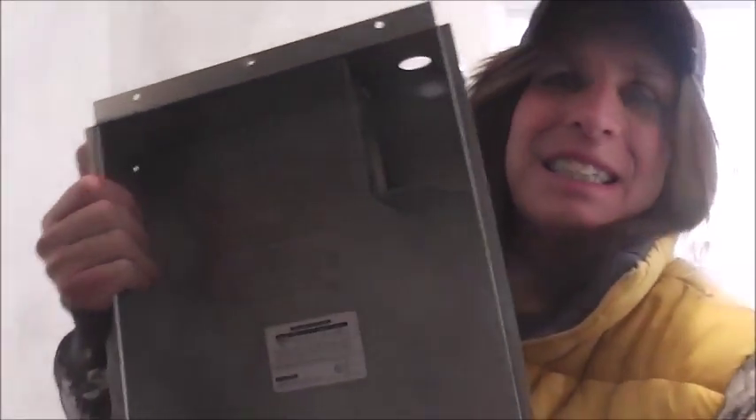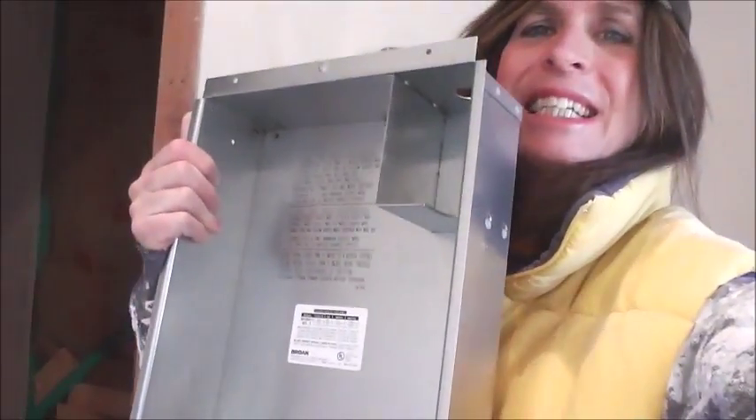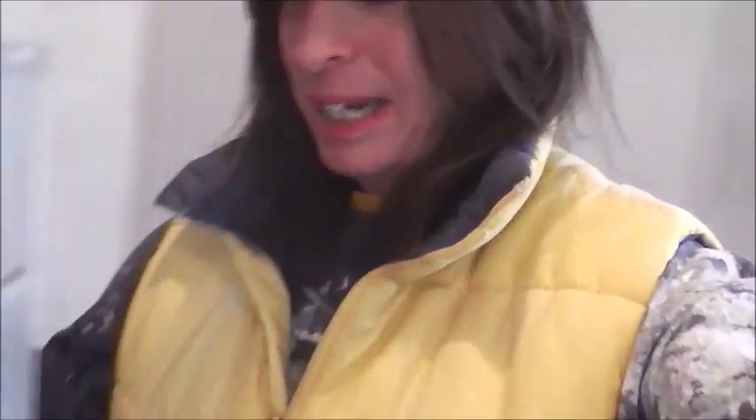So today I brought out the casing — the housing for the heater unit. I want to slide it in here. Let me put a little light on here. You can see it's going to go right down this area right here, and you can see how nicely it's already set on that stud, which is perfect. I want to pull that up to about right here. You can't have it any more than six inches from the ground — the blower, the hot air comes out the bottom. I want to set that right, then put the sheetrock right over top of it.